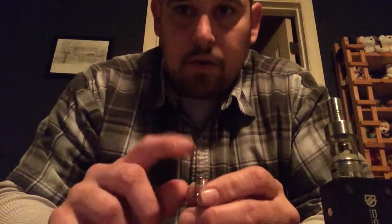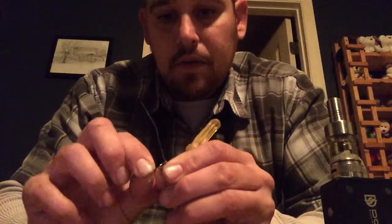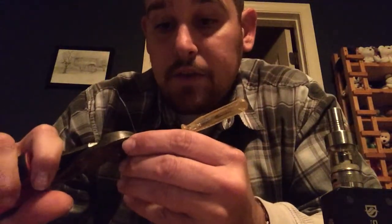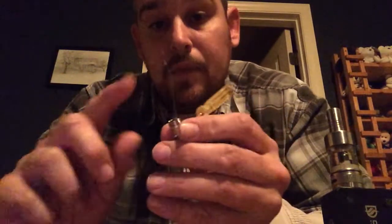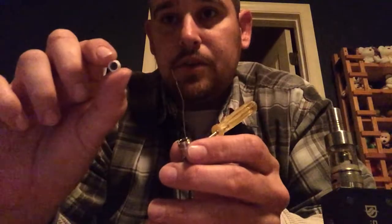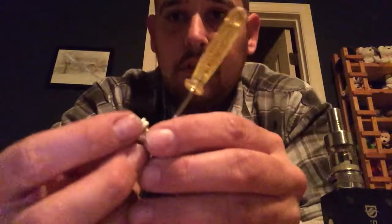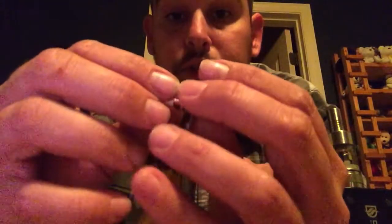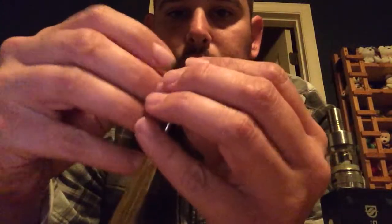First thing you're going to do is get your ground coil, which will be on your outside. What I do is I just bend it over right here, so it'll be bent over to the side. And then you're going to clip it right on the edge, a little bit further back from your threading here, so it doesn't get caught up on your threading. With the second piece here, you're going to go back and get your little grommet. You're going to put your grommet right through it like this, and then there are little notches on there. I don't know if you can see it or not. There it is, and that's going to get pushed in where the notch is on the metal. Okay, just push it right in there.